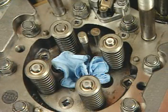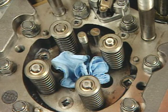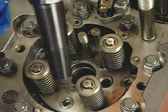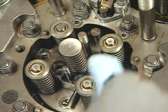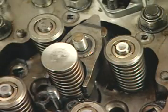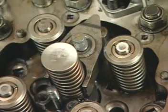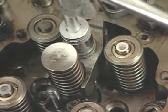The injector and rocker arm assembly of both the new cylinder as well as the opposing cylinder (opposite bank) can now be applied. Remove the clean rag from the injector well in the head. Remove the applicable MUI or EUI injector for your application from the injector holder and wipe clean with the rag. Install the applicable unit injector into the tapered well in the cylinder head, checking that the locating dowel is seated properly and that the injector is centered between the valves. Place the injector crab over the injector crab stud and lubricate the threads with Texaco Thread-Tex number 2303 or the equivalent. Place the spherical side of the washer into the spherical seat of the crab. Apply and snug down the injector crab nut.